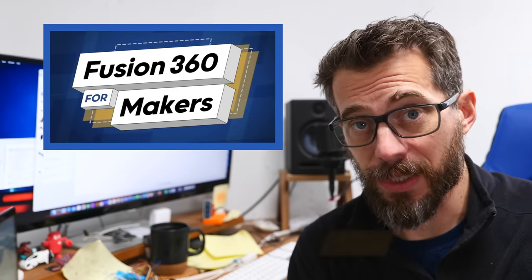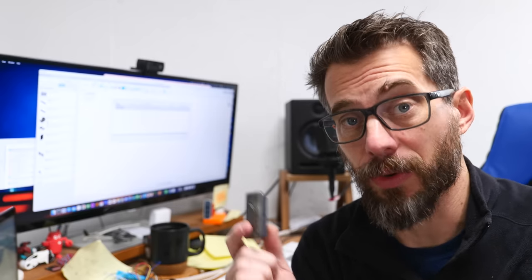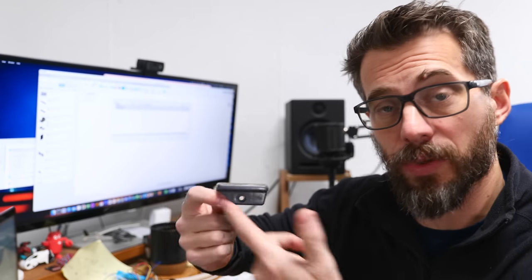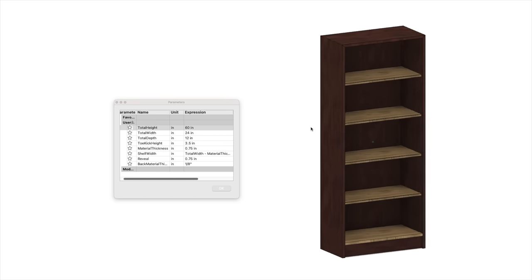Then you have to start modeling. I'm going to be using Fusion 360 because that's what I'm used to. We have an online course called Fusion 360 for Makers that will take all of this way deeper. But whether you use Fusion or something else, you're still going to have to get all those measurements and translate them into a 3D model. One cool thing about Fusion is that you can put measurements into parameters — basically a list of names and values. So you could say 'total width' and put in the measurement. Once the model is made, if you need to change something, just change the parameter and the model will react. Regardless of your software, you're going to have some trial and error, so get the first draft, stand back, see if it does what you need, and if not, feel free to start over.